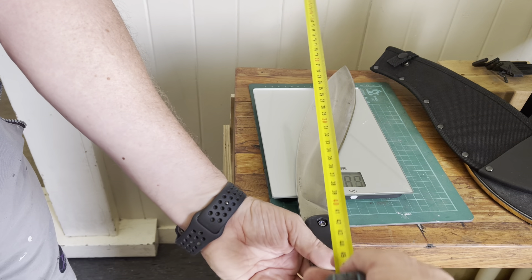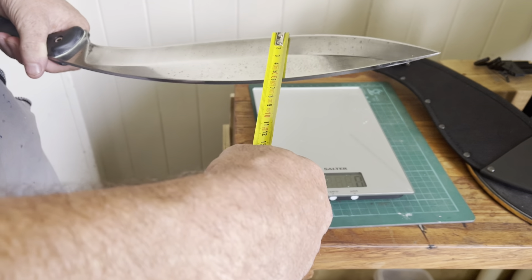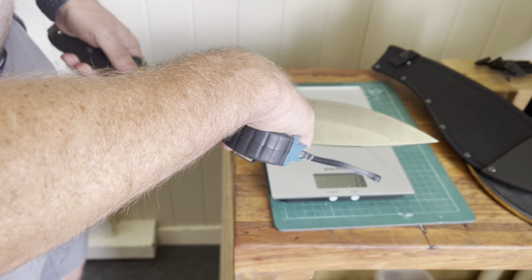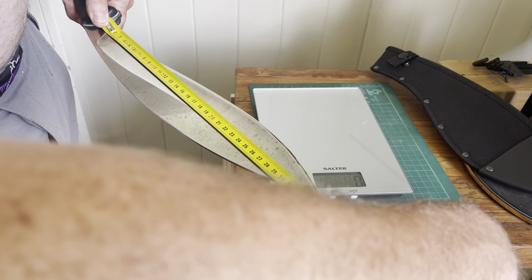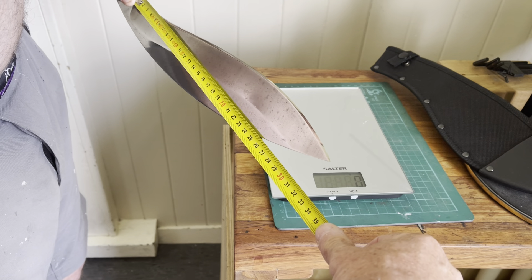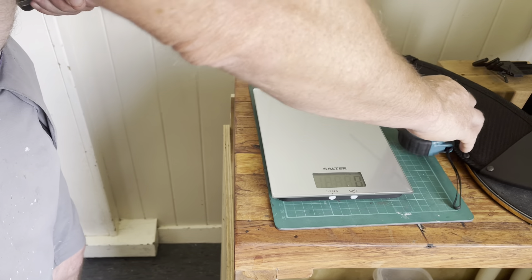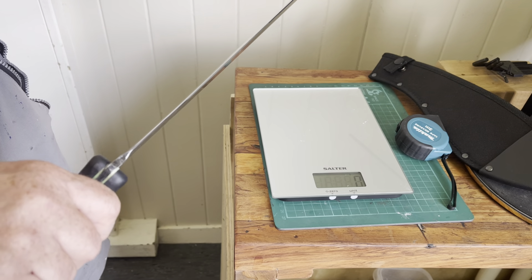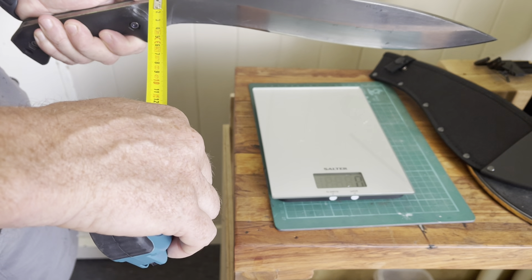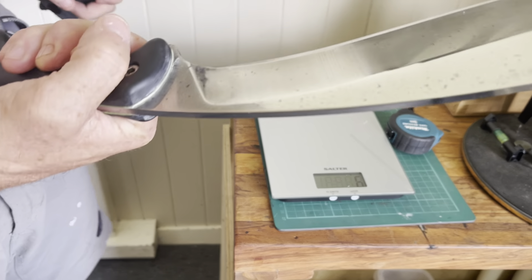Maybe 47 and a half. If you look at the little crown thingy you're looking at belly depth, and that's kind of the sweet spot — five and a half. The actual blade itself is 33 and a half; from the actual cutting edge to the tip, 32. And the thickness of the blade at the thickest point is just under five mils, so about 4.7.